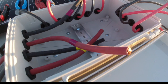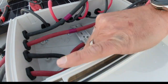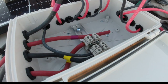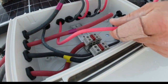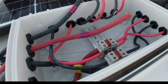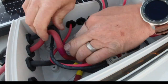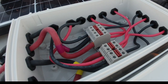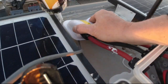As you can see, I'm set up to wire the combiner box where you bring in all of your solar leads and connect them to the wires going down into the coach. I use a DIN rail system to do all the interconnecting, and you can see the little red fusible links, which I'm putting in now. If you look at the wire gauge, it looks larger than it should be — and that's because it is. On every system that I design, I make sure there's less than a 2% loss coming in from the roof or interconnecting between the batteries and the multi-plus. The gauge here is 2 gauge from the interconnecting all the way down to the MPPT. All of the connecting between the solar panels is done with 8 gauge wire.